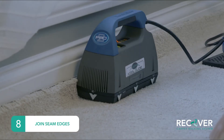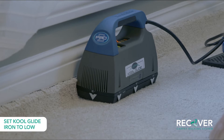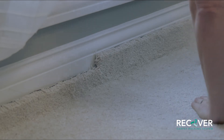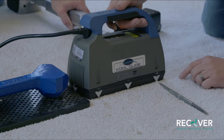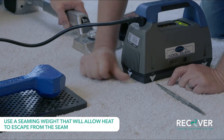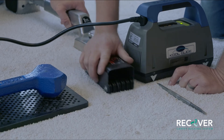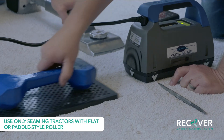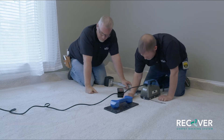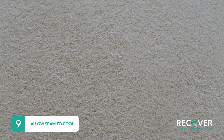Start seaming in T mode. Be sure the unit is set to low, with the unit in transverse position, and activate the unit. Then turn T mode off and center the unit on the seam. Continue seaming by marking and moving the unit arrow to arrow. Use an appropriate seaming weight that will allow heat to escape from the seam. When using seam tractors, do not use excessive pressure — use only seaming tractors with a flat or paddle-style roller. Allow the seam to cool before finishing the installation.